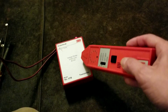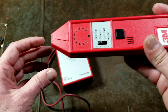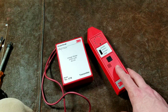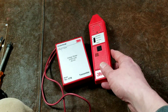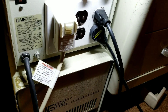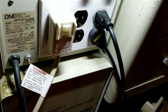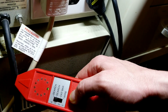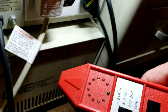When you get near a block of circuit breakers with a highly sensitive unit, it starts going off everywhere and you can't find the exact one. The biggest use case for these tools is finding the specific circuit breaker for a particular outlet or fixture. The remote also has a speaker so you can hear the signal tone while you're working. Near an isolation transformer the signal is almost completely filtered out — it's barely ticking even at the highest sensitivity.